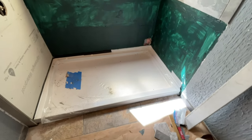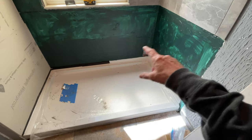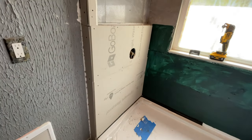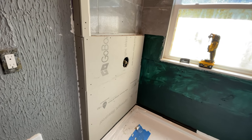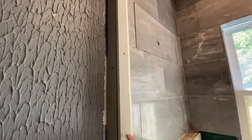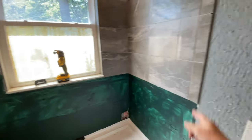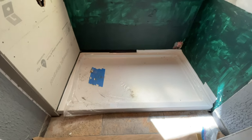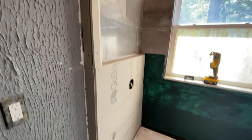Waterproofing of the wall here - this is a new very lightweight cement board, fiberglass. It's good for showers, walls, ceilings, etc. This had to get bumped out so the door would fit between here and the other side over there. There's mortar down on that and it's set in place and it is absolutely level. So now we're just waiting to tile.